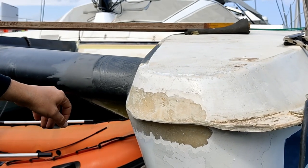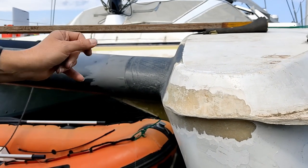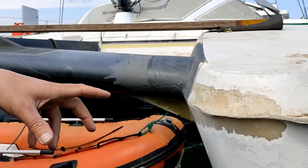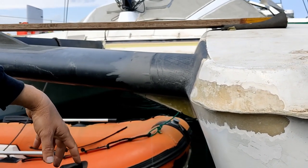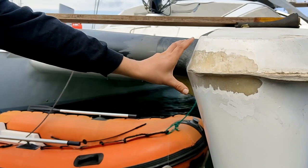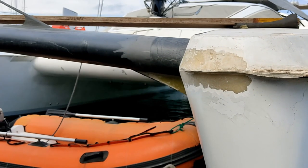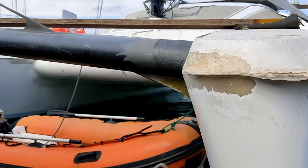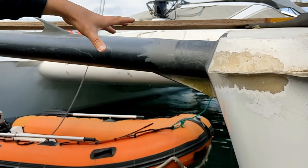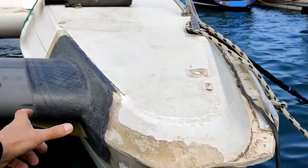This is now a very structural part of the boat and has become a large stiffener for the front end. Our boat is now going to be stiffer. The issue is we are now taking some of the boat loads and transferring them into the beam — so when the bow wants to rack up and down, that racking load is now going to be transferred from one side to the other through the beam connection. The beam has to be quite stiff in torsion, which is why there is a very large amount of double-bias layup in and around the socket here.